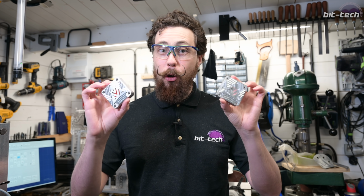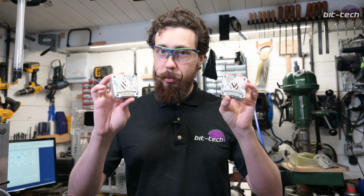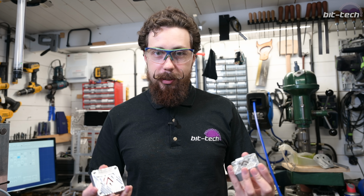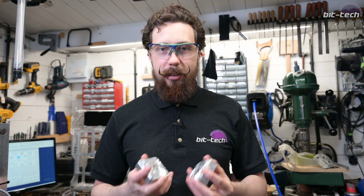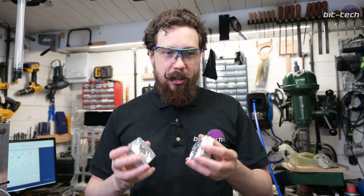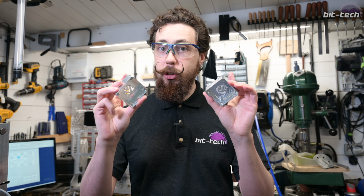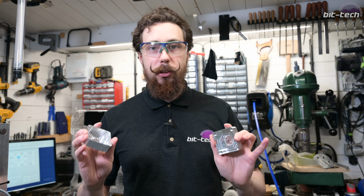We're getting there. We've got two almost finished pump heatsinks now. We've got the fins all machined in, which was absolutely harrowing, to say the least. The tool paths are fairly conservative, but it's always a little bit dicey when you're using 1.5mm end mills on aluminium because the tiniest little bit of vibration, you get some chatter, and remember, these are completely hollow, so there's lots of potential for chatter in a part like this. And a single bit of that, then boom, it'll just snap.